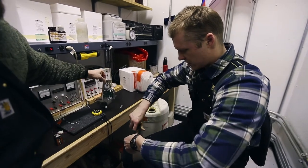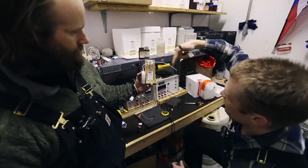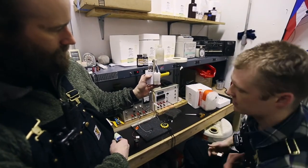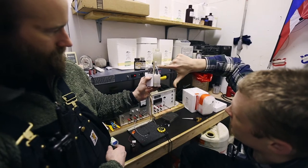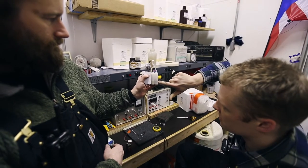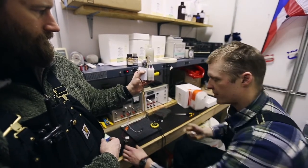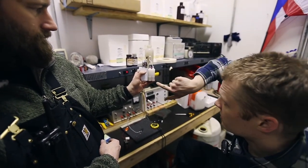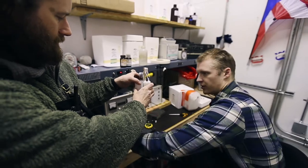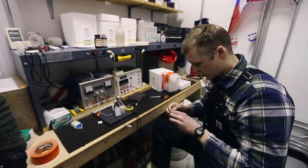Interesting. What's the instrument actually measuring? So the instrument is measuring current, which most instruments do. This little pump here sucks air in this tube and it comes down in this little cell. This little cell has a cathode side and anode side, so it's like a battery. As the ozone molecules in the air come down, they react to this cathode and electrons are released. Electrons flow across from the cathode to the anode side, just like a battery does, when you connect the circuit. So we measure that little current; the amount of electrons released at the cathode is proportional to the amount of ozone in the air that's coming in. That's the short version of how it works.